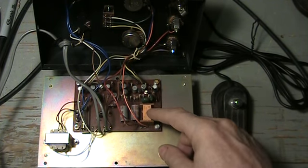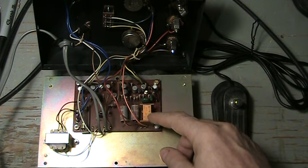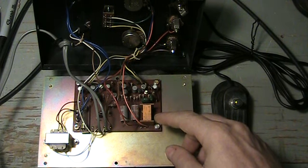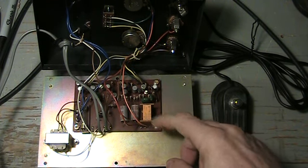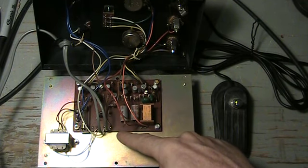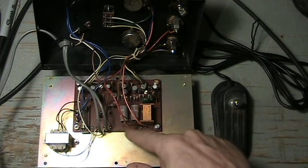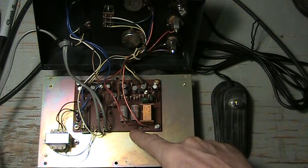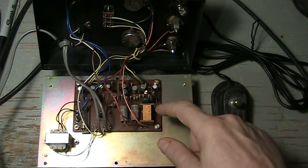The coil for this is actually got about 420 ohms. The old relay had about 260 ohms. I measured it. And they work off this first. There's a resistor between these two filter caps. So this is the raw, which is about 14 volts, and this is the 9 volts for the pedal.